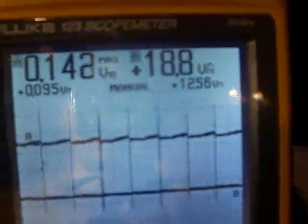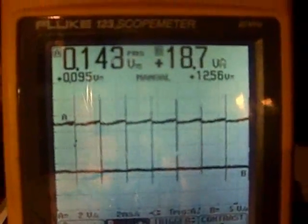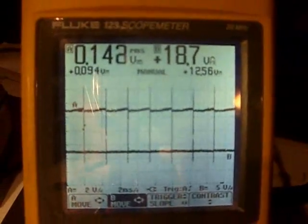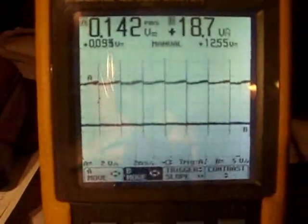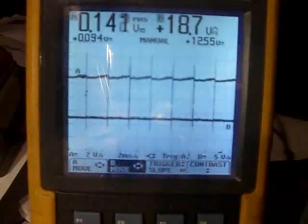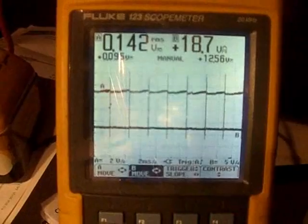You can see the 12 volt battery DC mean is sitting at 12.56 and it's slowly climbing. There's no recovery battery — it's just a front end battery. The inductive kickback is that reverse current going backwards to the intrinsic diode in that MOSFET, sending a recharging pulse back to the front battery. So the current pulse leaves the battery and then it returns to the battery.